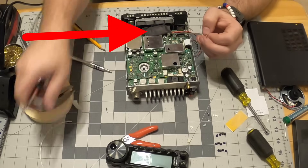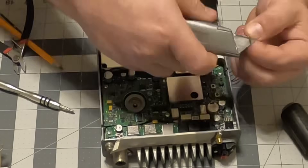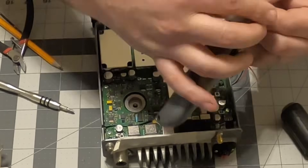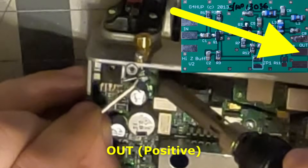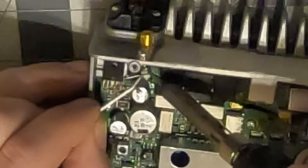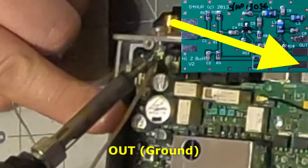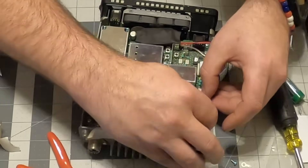I'm going to trim the coax cable. That red arrow is showing you the heat-shrink board with all of the wires soldered to it and coming out. I'll use this knife to remove the outer plastic sheath, then pull out the braid so you can solder it. You can see I'm soldering in the output — the center conductor on the coax — and then we're going to put the ground of the output to that little solder lug. Each arrow is going to show you which wire you soldered to the board, so I hope you kept them straight when you put them in the heat shrink. The kit comes with some tape to hold things down and keep them from wobbling.